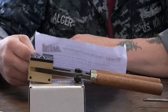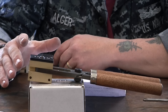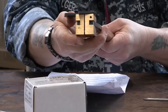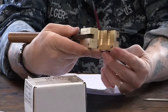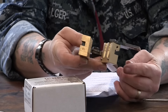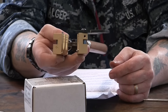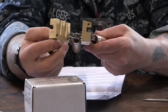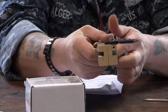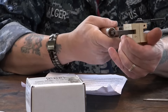The instructions also cover wrinkled bullets, breaking in, and movement of the block. They tell you brass is soft, so be careful and try not to slam the mold shut — just pay a little more attention. The pins down in here will deform the holes on the other side. You can kind of correct it by tapping the alignment pins out a little. But it says in the instructions that most of the reasons people send molds back — because they don't line up or lock right — is because they damage the alignment holes by closing the mold too quickly or being too rough with it.